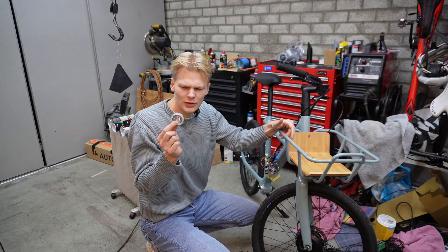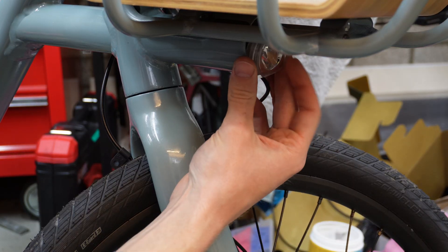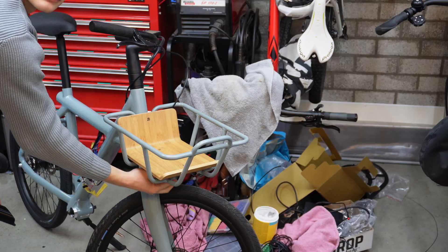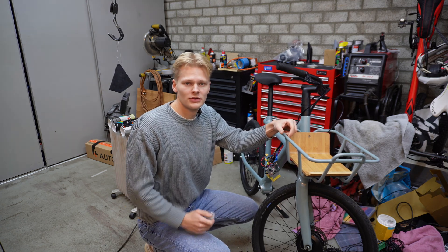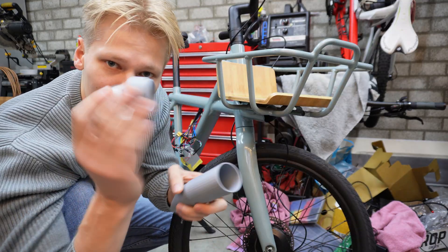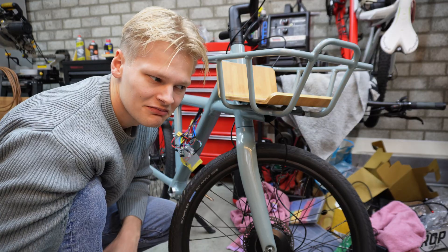This right here is the headlight — or part of it. I was trying to convert this just like I did on the rear light, which worked perfectly, but there's a small problem: when you put the basket on this bike, the headlight ends up sort of in the middle of or underneath the basket. You won't really see the headlight, and while you'd see the light shining on the ground, on a cold rainy dark day that's just horrible. So I figured I'd make some extension tubes to fill up the space. This is the first version, which didn't work very well, and this is the second version — the lens goes in here and the light will be all the way up here, which I think is a lot better. Did I miss some parts with this bike? Let me know in the comments.